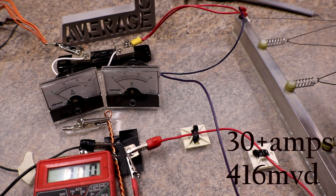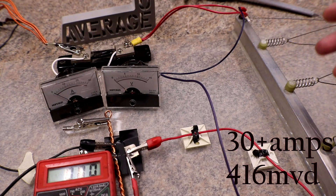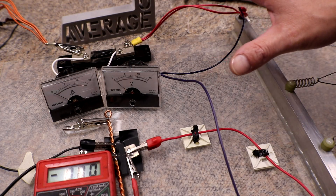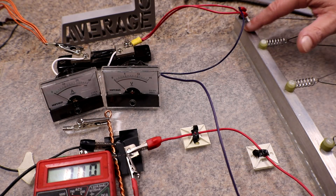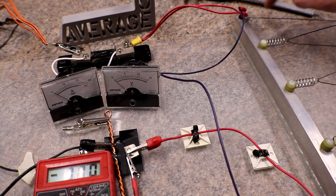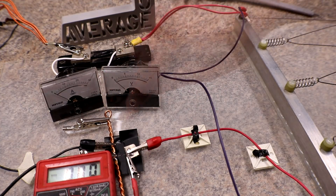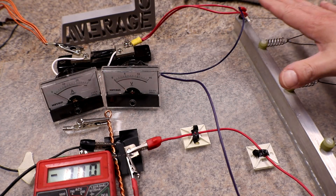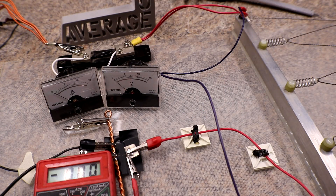What we learned there is it takes roughly a little over 30 amps. This is on the 3 volt rail and this is the negative side wire. That right there was a dead short — it wasn't popping when I was tapping, so I just put it to a dead short and you could see the meter peg out and the wire did pop. That is exactly what you want for a negative side — if something does happen, you want it to fail if it can.